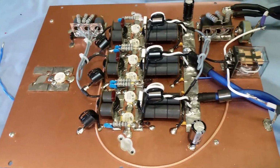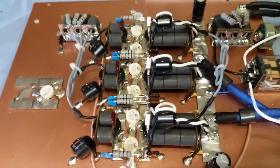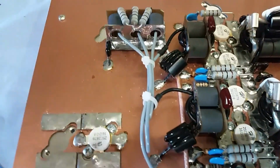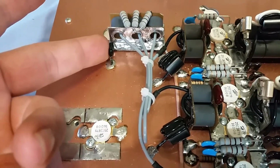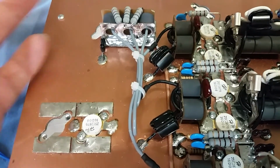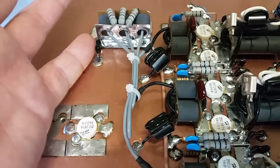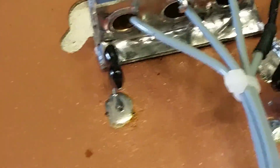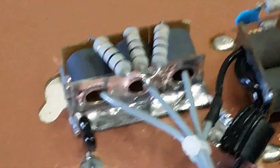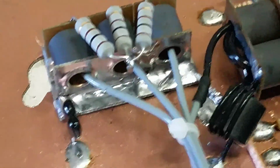and you notice a little too much input or output reflect, you probably won't have much issue on the output, but if you have any kind of input reflect rise up on you, as you'll see here is the input loading cap right here. This is the input tuning cap. It normally tunes out to 180 or so on a Toshiba box. This one tuned out about 205 picofarad, so there's a 205 picofarad cap on it right here. This is your tuning point for the input right here on this port, so that if you ever did need to put a trimmer or something and take that off, that's where you would do it.